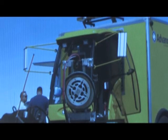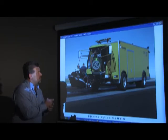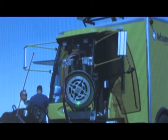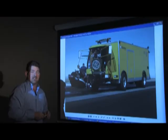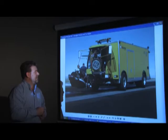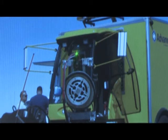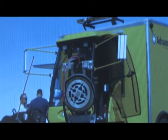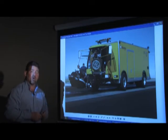Now, what else is eliminated? The heads here are very closely sized to the shroud. In fact, if you look at these pictures, there's probably not a quarter of an inch around from the shroud to the cyclonic bar that creates turbulence under the head. I also have to question how much those cyclonic heads cost when they have to be replaced, subjected to the abrasive environment produced under the blasting shroud. Additionally, if you were considering this machine for highway use, you'd have to think about how close you could get to a barrier wall with these setups. From here to here must certainly be more than 14 inches, whereas with a StripeHog we can get within one inch of a barrier wall or other linear obstruction.